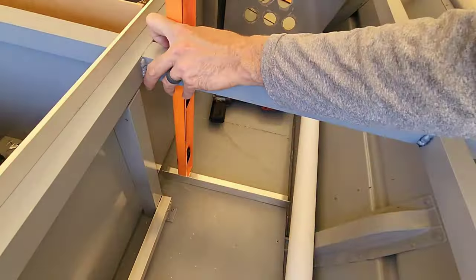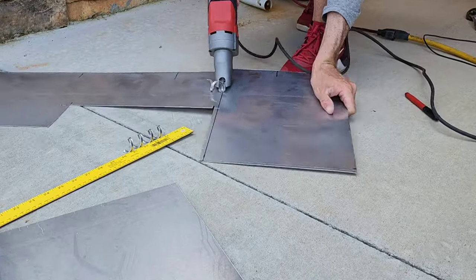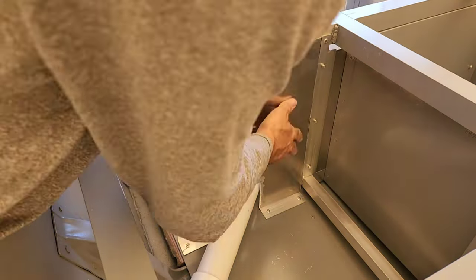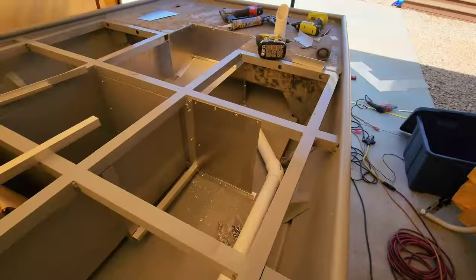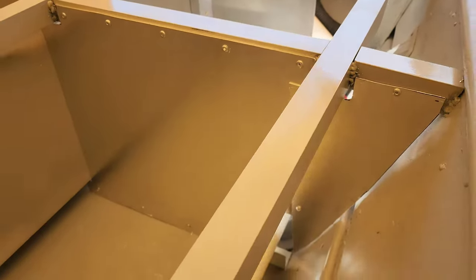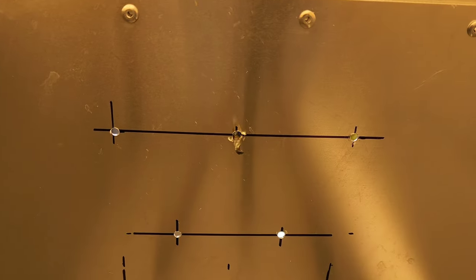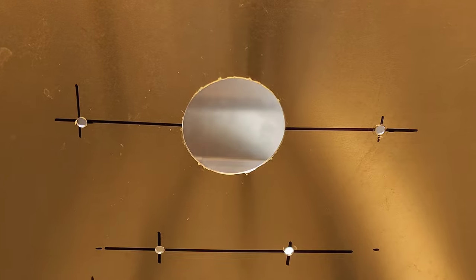I began by measuring layout and then drilling my holes. From there, I added some angled framing to attach some sheet aluminum. I would end up framing and sheeting in a total of 4 additional panels, creating 6 quadrants from side to side. 2 of these quadrants would end up getting some pour foam, but more on that later. I would hole saw a total of 48 holes for the 1.5-inch rod tubes to go through.